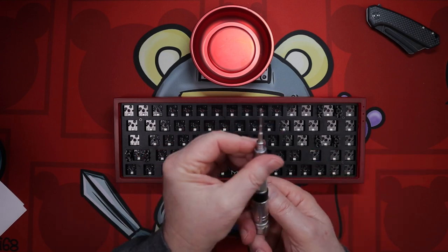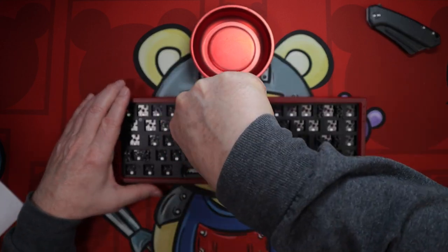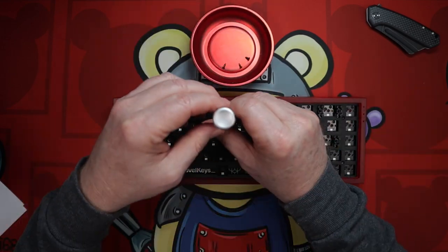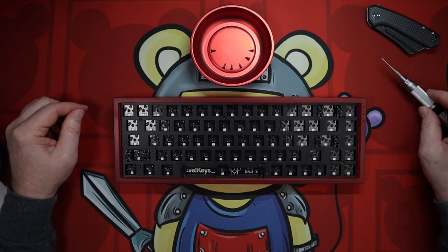I have skipped clipping stabs for now. I will update this build at a later time with several mods, including clipped stabs with a bandaid mod on the plate, as well as foam from Stupid Fish. If you have not tried their product, link below — I highly recommend it as it is excellent and a very affordable way to get a keyboard to sound so much better. Building this board can be done fairly quickly, but I would still take my time and do things slowly. The first step is to remove the screws that hold the case together. I don't use power screwdrivers on any acrylic or polycarbonate keyboards, as it is simply too easy to over-tighten and strip something. I suggest not only tightening the screws partially in a random cross fashion, but loosening the screws like this as well — this prevents undue stress on the last remaining screw and could save you from breaking something.